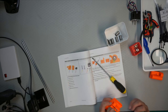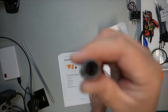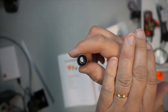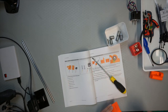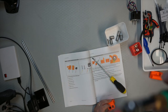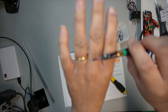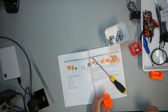I really would not like to force the bearing. If you look at the bearing, it's rubber with a very thin casing. You don't want to be pressing on that rubber part — you could be pushing out the bearings, the small round balls. So I'm trying not to do that. I'm using that flat part to push at the bearing sides.